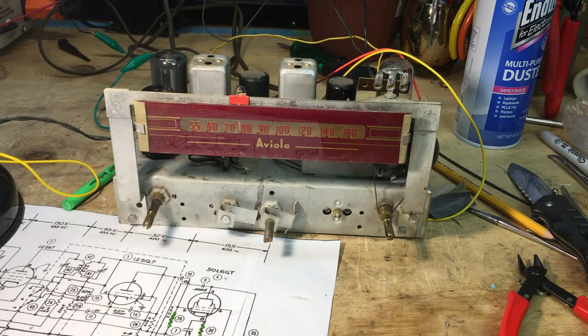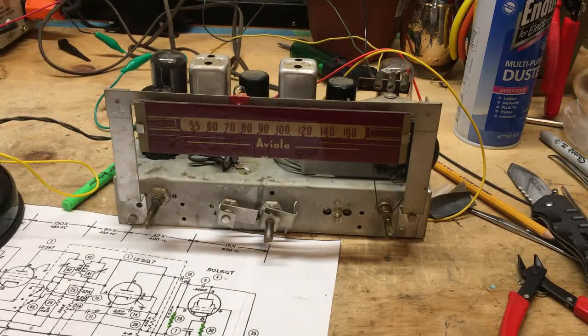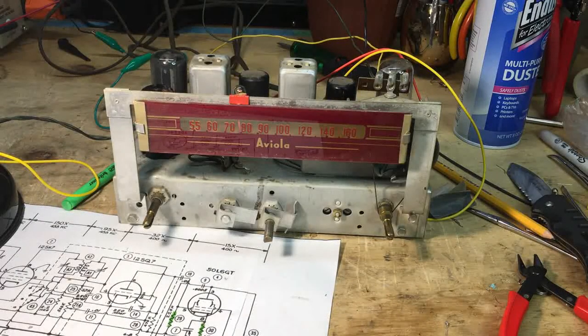Still less than 200 milliamps, fading back a little bit. It jumped up, so we're going to condition these capacitors since they're new. Current's looking good. I'm starting to see a faint glow in the dial light. I don't know if you can see it or not. But, all right, let's pause this and let it set for a minute or so. Okay, let's run it on up to about 90, and we may start hearing some sound. Current still looking good. It's climbing a little bit.